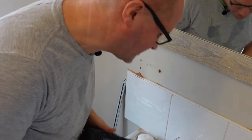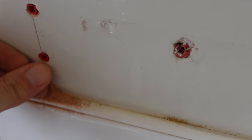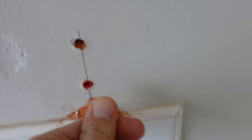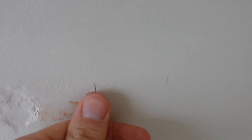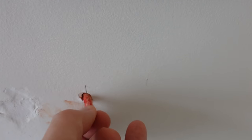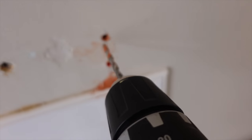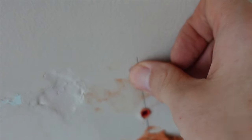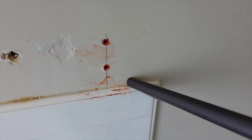Time for drilling! I'm going to go for a number six drill bit to fit this raw plug, but I'm going to get a smaller drill bit to start with just to get a pilot hole, because it's a lot easier to be more accurate and then I'll make it bigger with the proper number six. Didn't go quite as straight as I'd hoped. Here's the moment of truth to see if these fit in the holes. Yes, number one! Yes, number two! I was worried about that one. Yes to number three! Fantastic! And the final one — number four! There's some brick dust inside... number four, please please please! Yes, perfect! I'll clean up the mess so that the shelf can sit neatly on the tiles.